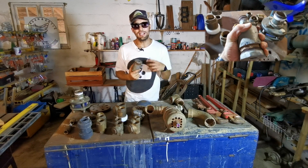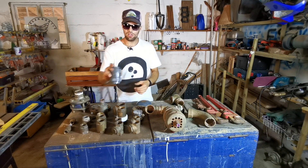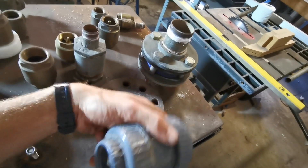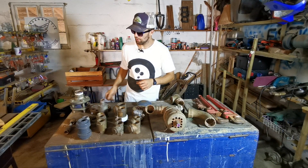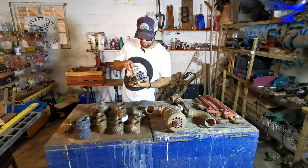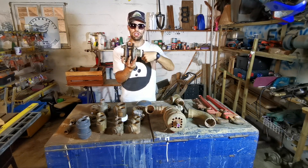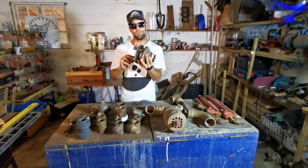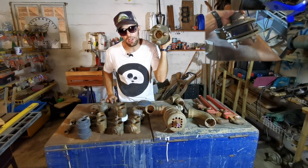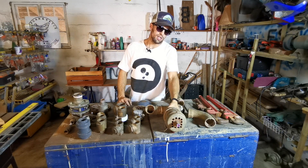I needed more water, so I went and tried PVC — that lasted about a day before it popped. I then stepped it up and got a big butterfly valve with two little flaps inside that close up to allow water one way but not the other. The springs on those broke, and I couldn't find spare springs anywhere. So that didn't work either.